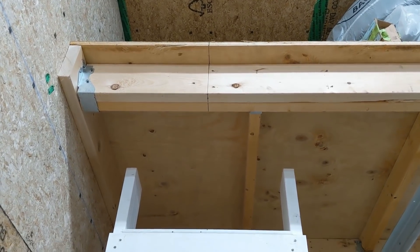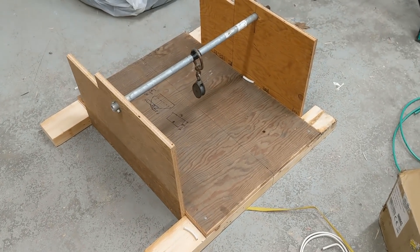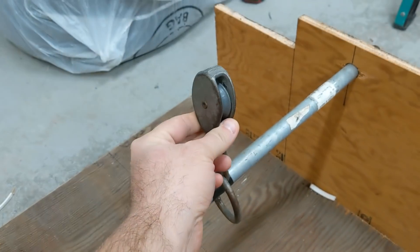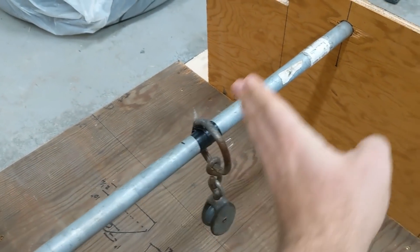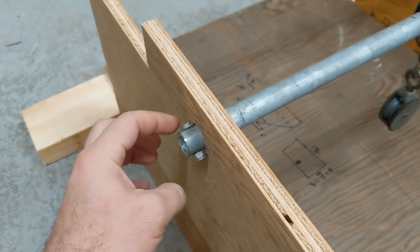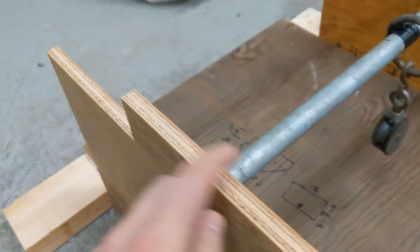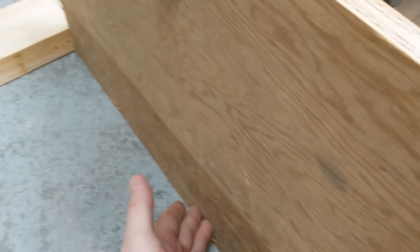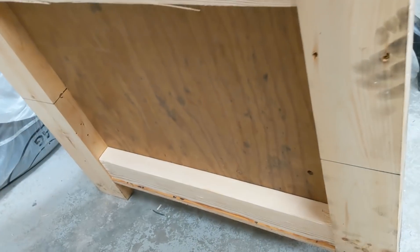I made a line up on the loft which corresponds with the center of this rack. This is the carriage I threw together to hold the batteries, so I'll be able to lift from this pulley up top to the beam. The electrical tape here is just to keep this ring from sliding back and forth on the steel pipe. The steel pipe is held in place with a couple of bolts going through it, and it is a thick steel pipe so it's not going to bend on me. The plywood I actually had to notch to fit around the upper beam, and all the weight is transferred down to the 2x4 frame which is on the bottom.